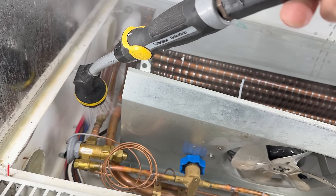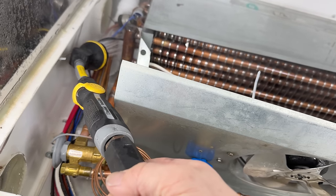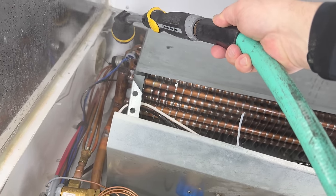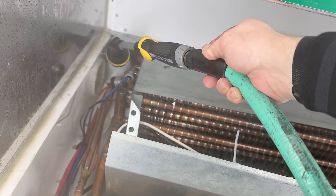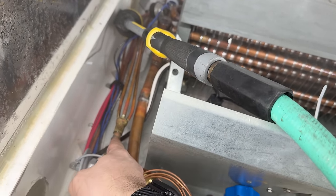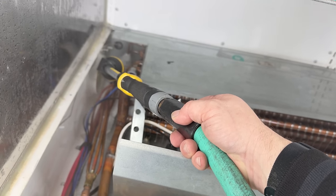It's hard to tell, but since the heater element looks like it goes completely underneath the coil to the back, it may actually get it pretty good back there for me. Hot gas defrost doesn't have that. A lot of times that's what I'm defrosting — those type of coils where you use the compressor hot gas to reverse flow through the suction, come out about right here before the TXV. Then it returns on the liquid line back to the rack and is reused throughout the rest of the system.